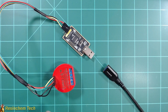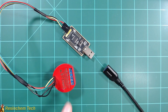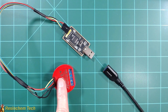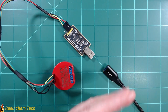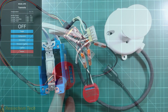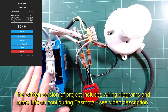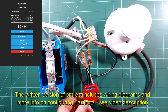I'm not going to cover the actual process of flashing Tasmota on here as I do cover that in another video. The Shelly 1 makes pin headers readily available, so a couple of DuPont jumpers and a USB to serial adapter is all I need. I can go to the Tasmota website and flash Tasmota straight onto this. I've finished flashing Tasmota, put it onto my Wi-Fi, and done the basic configuration to tell it that this is a Shelly 1 PM. I always like to do a quick bench test.